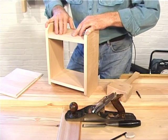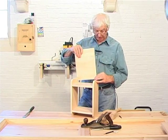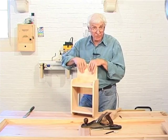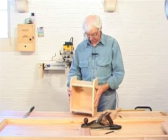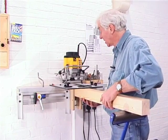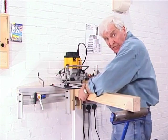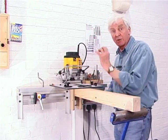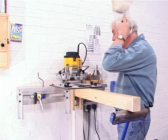Shelving is done in the same way. It's so much quicker than a mortise and tenon joint, and so much stronger than the Dado joint. I suppose one of the most necessary actions in woodwork is to put a leg on a table. The usual way is with a mortise and tenon joint, but the Woodrat can simply pull a sliding dovetail using the mitre box.